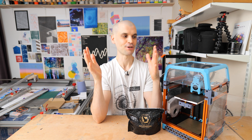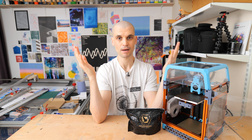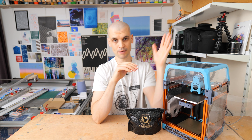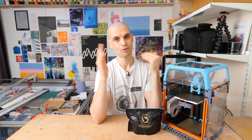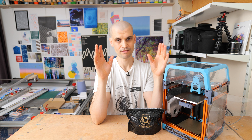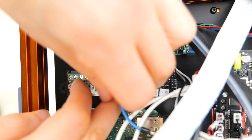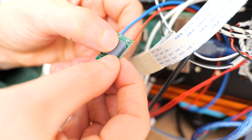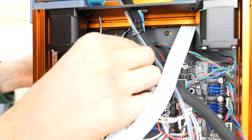I went with the Klipper expander board route. However, I mistakenly thought it would magically output 12 volts - it doesn't. Whatever voltage you feed into the Klipper expander, that's what comes out of the MOSFETs. So with 24 volts in, you get 24 volts out. The solution is to use a buck converter to step the 24 volts down to 12 volts before feeding it into the Klipper expander board. The expander board was about £18-19 and the buck converters are very cheap - around £1-2 each from AliExpress. They're tiny and you can mount them anywhere on the back of your Voron.